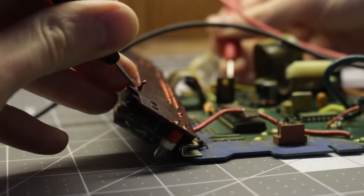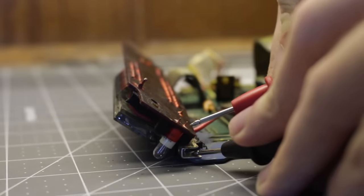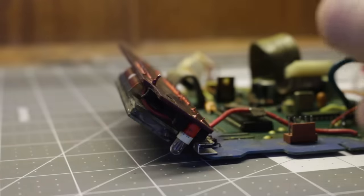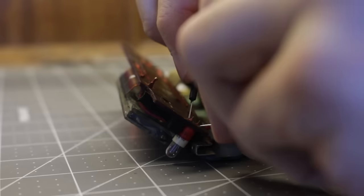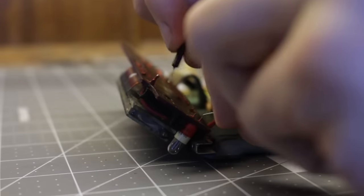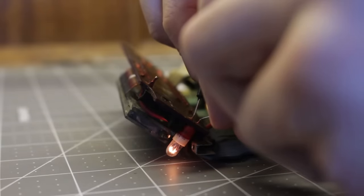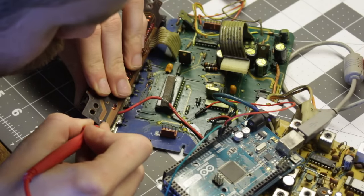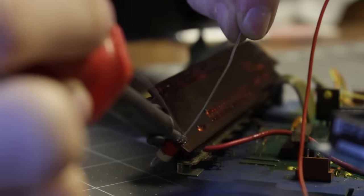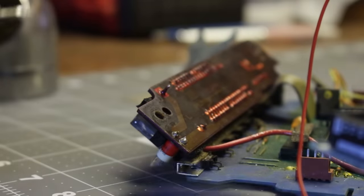I thought at this point, maybe it's the ground that's bad, which is shared with the display, so that could be why they're both faulty. But nope. I got out the junky power supply again and tested it right on the solder joints this time. The other light turns on — you can see the glow on the mat — but still nothing here. What if I just check the actual pins directly? Well, would you look at that. It looks like we got ourselves some broken solder joints, boys. And that is an easy fix. I scraped off the rest of the conformal coating around the joints, then reflowed the solder, and also added way too much new solder. It's a globby mess to say the least, but hey, it still should work just fine.